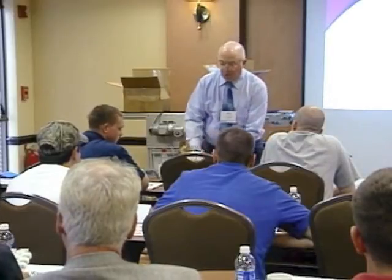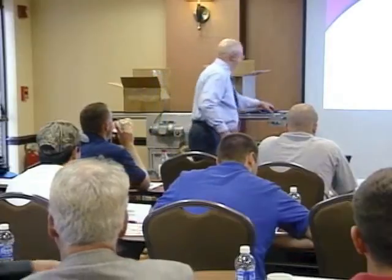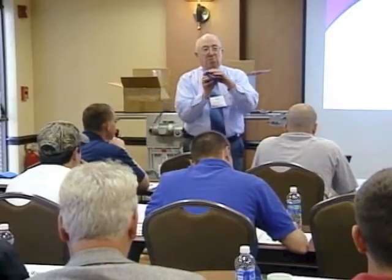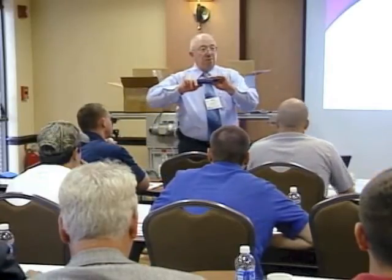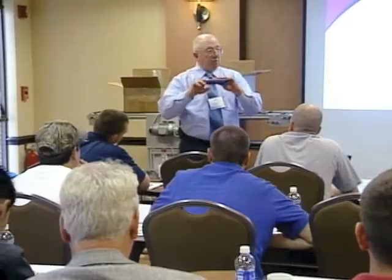You go down to a 1/2 inch pitch, which is generally the smallest. This happens to be a 1/2 inch pitch version. This will get you around much smaller sprockets. You can even run this around a nose bar or a nose roller. We recommend roller because it reduces the amount of drag as it comes around that transfer point.